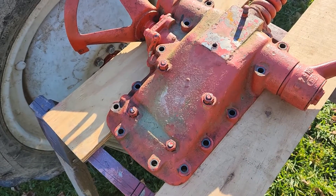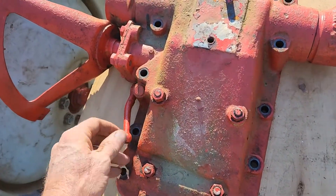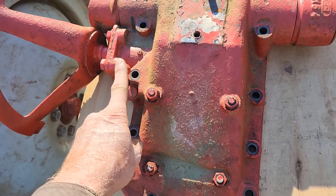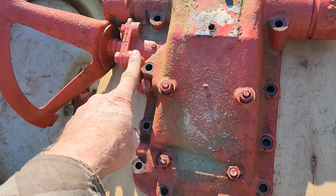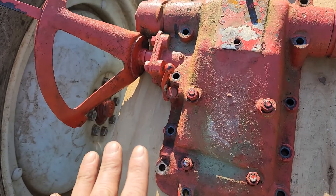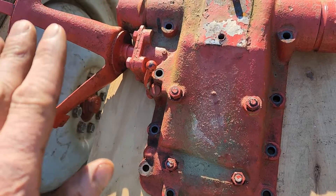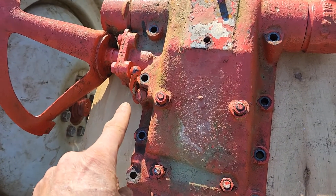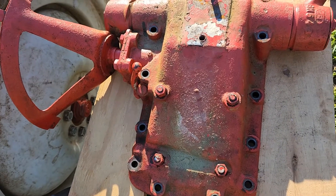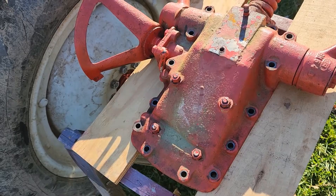I've got the piston cylinder bolted back up. This little lever here is your draft control, and that was where the broken spring was hooked up. I think that's probably why my draft control would never hold — I could never set the three-point to a certain position; it was either all the way up or all the way down. I'm hoping that replacing the spring will fix that. That's about all I can do now until I get that spring and I'll be ready to put this thing back together.